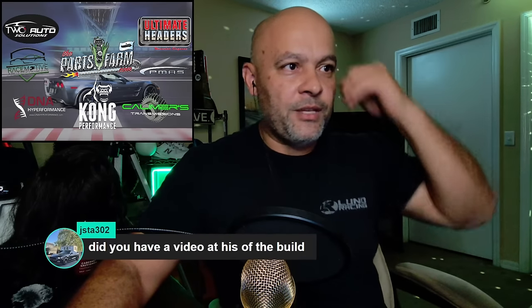You lost it? You probably had an OPG failure if they were stocked. If you bounced it off the rev limiter and it says, spun out at the track, bounced it off the rev limiter on the 3-4 shift, 110 miles an hour, saved the car, but lost oil pressure, you probably killed the oil pump gears. Did you have a video of the build?